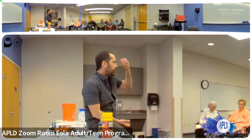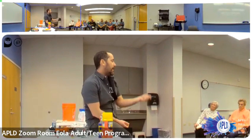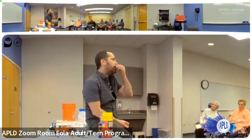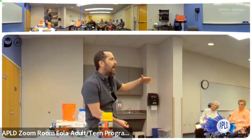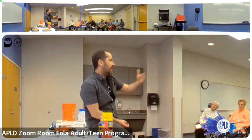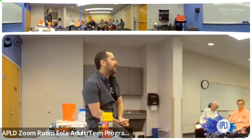How does that keep water from coming up in your basement? It's not going to, if you've got a leak. You can't just paint over that. Right, that'd be some serious pain. But some walls don't have a leak, but they allow an amount of moisture to seep through over time. And when it really rains a lot, it'll just be wet. Or the basement is so humid that you'll actually have condensation, which is moving the other way. And then the paint protects the block from that water. But that's all it is. It's not going to stop a leak. There's no paint that'll stop a leak.